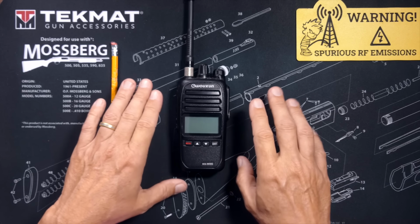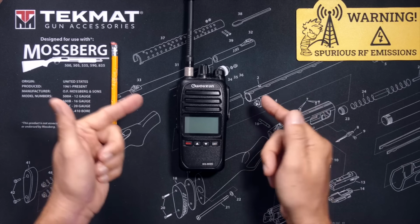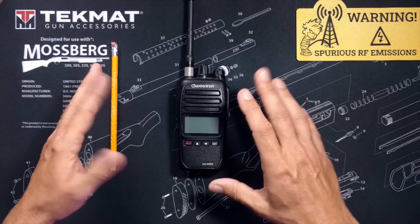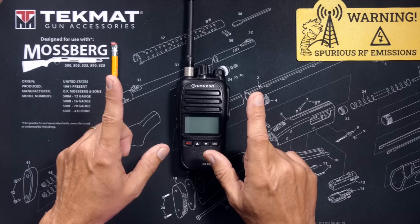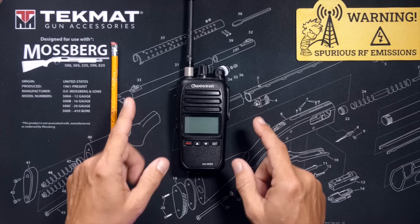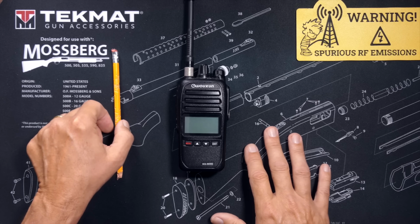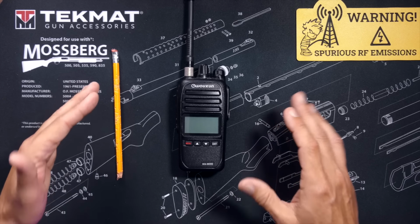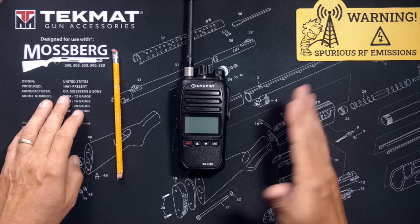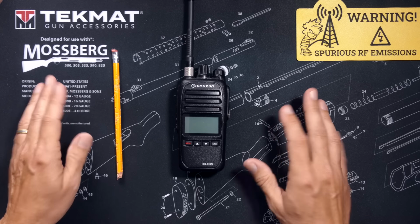And if you just jumped up from your seat and started furiously typing a comment to declare to everyone that I am wrong about using a ham radio on GMRS repeaters, or that you must also have a GMRS license or permission to use a repeater, just sit back down. Yes, it is possible to use a GMRS repeater with some non-GMRS radios. However, it is not as simple to configure a repeater on a non-GMRS radio as it is to do on a GMRS radio. That is one of the big differences between a real GMRS radio and a ham radio or a business type LMR or UHF radio.